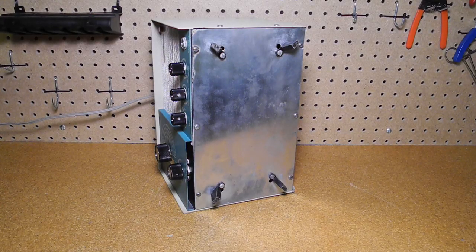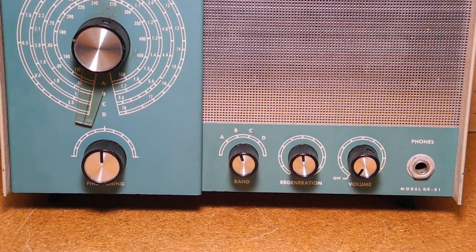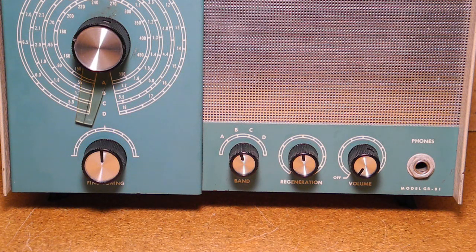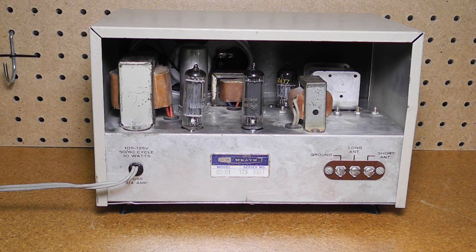The plastic feet on these units are often broken or missing, but mine has all of them. It also has all the original knobs. Some units had a pointer on the fine-tuning control, but others do not — this appears to be a design change made over the years. This unit had some corrosion on the chassis, but nothing serious. One nut and bolt were missing from a tube socket and were replaced. Often the paper capacitors on radios of this vintage have become electrically leaky. This radio only has one paper cap, and it seemed to be okay, so I kept it original. There are three electrolytic caps in one can — they also can go bad, but these ones seem to be working fine, so I did not replace them.